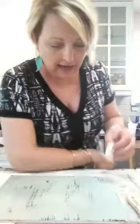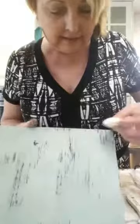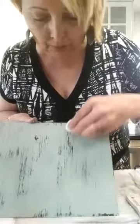And then we'll take the layering wax bar. I love this stuff. We do have some cracking and chipping. I want to put a little bit of this layering wax bar over some of these areas where we have the black coming through, because we really want that paint to chip off and flake off in those areas. Maybe I'll add a little bit more hemp oil so you can see the difference of using hemp oil as a resist and layering wax bar.